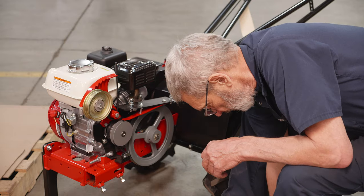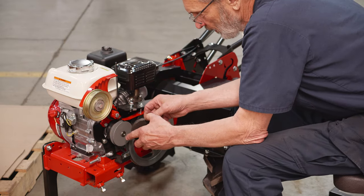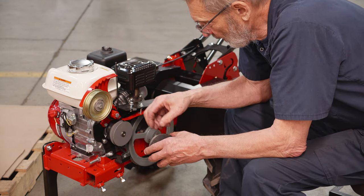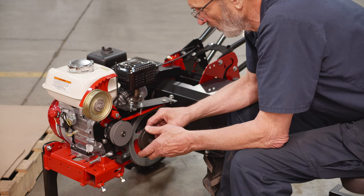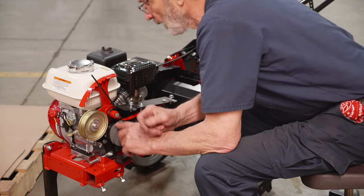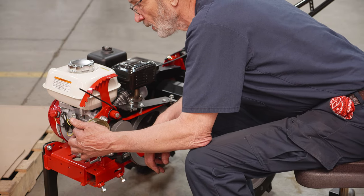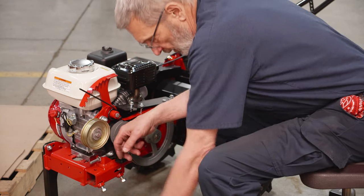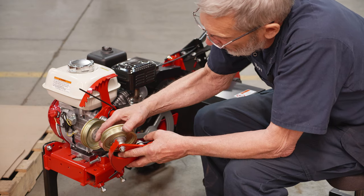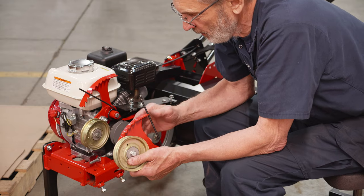Here's the pulley. The pulley needs to go on where this pulley is, and there's a short key here that goes in there. You need to tighten that set screw down tight when you get the pulley on. Push it on as far as it'll go and that'll be its location. This pulley should line up with this one. It can be adjusted with more or fewer flat washers on the back side, and it's set to the approximate location to feed the belt back to the attachment.